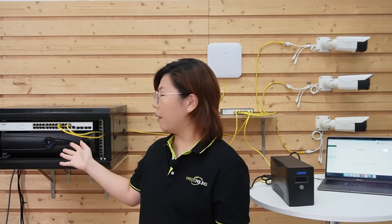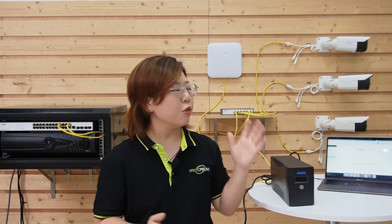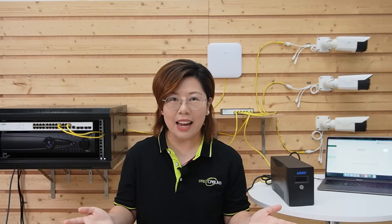Down to our final recap: use PoE++ for high power budgets. Use a PoE power switch on each floor to send power and data to all devices. Isolate your devices with VLANs, and use centralized UPS backup. With Power over Ethernet, you simplify a complex setup.